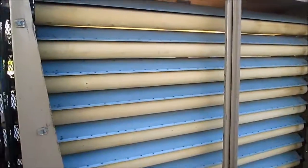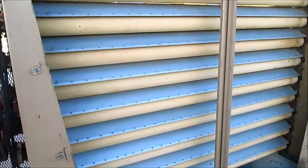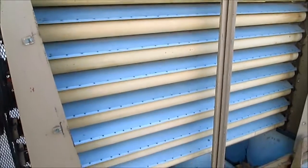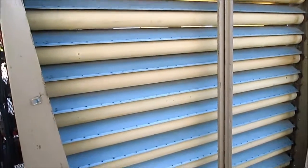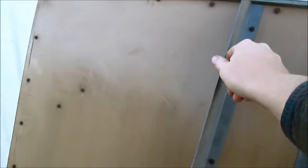This is the 20 roll unit from the other side with the doors off for inspection. When you're running seed you will have to have your doors on. These are the doors — each door has a slat or wall on it that keeps your three grades from mixing, and also catches seed being thrown out from the machine so it hits the door and falls down to the hoppers.